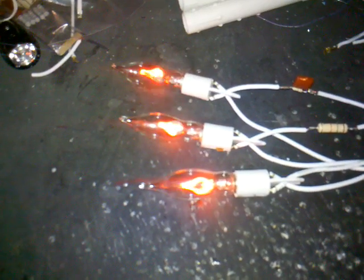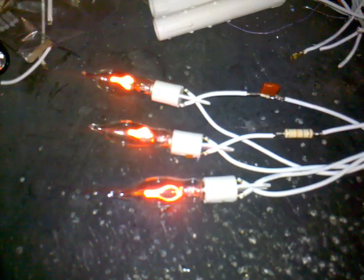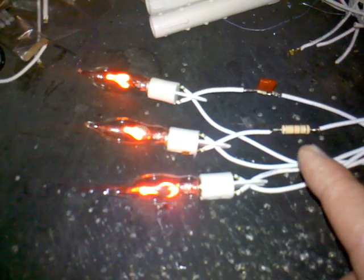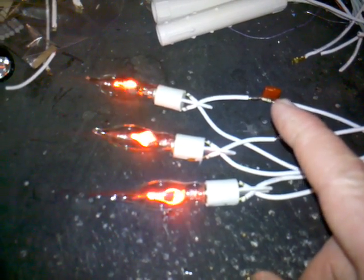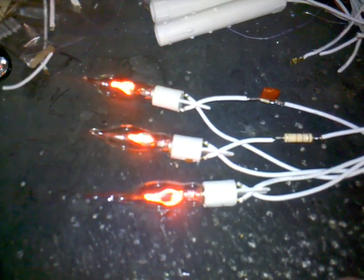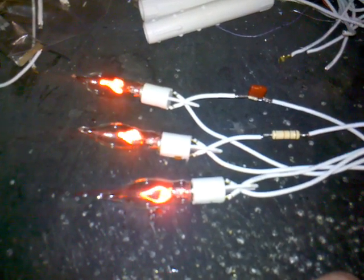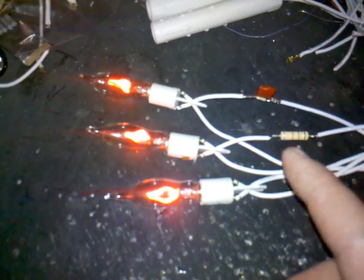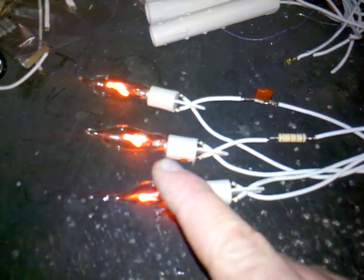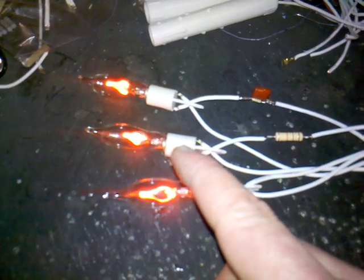This is 240 volts — it won't be so critical for the American ones. However, I've been experimenting and I've put a resistor in series on the lamps and a capacitor with a parallel resistor in series. The parallel resistor is a 1M resistor — it's just a discharge resistor to stop you getting a nip when you turn it off, because otherwise the capacitor would store a charge. The idea of putting the resistor in series is to limit the current externally and reduce the power dissipation in the resistor inside.